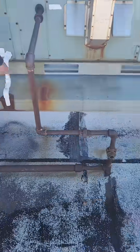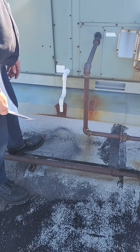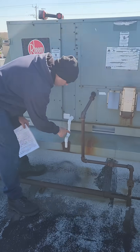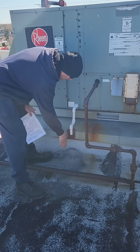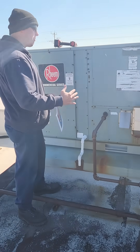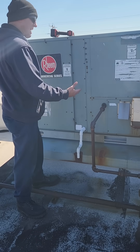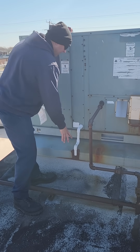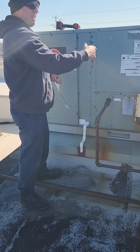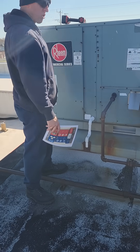I look at this drain and they're like, yeah, it works better if it's draining down like that. The problem is when you've got the drain going this way and it's draining down, you're also sucking in outside air. And then what happens too, when you're pulling in that outside air, as you're trying to condensate with all that water, it starts blowing around and then your ductwork starts getting wet and it starts dripping out of your ductwork.